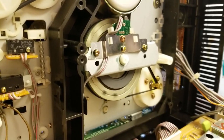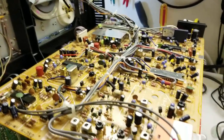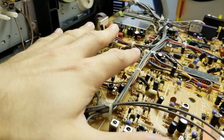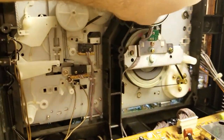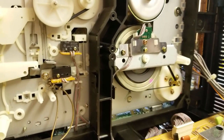From what I've read about this model it's plagued with apparently blue Sanyo bad caps. I'm going to go looking, doing some digging and reading, and maybe spot check a couple. This will definitely need a recapping if these were known to be bad and this thing's like never been used. It's not actually starting to play - now it's just staying in pause.